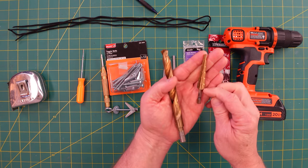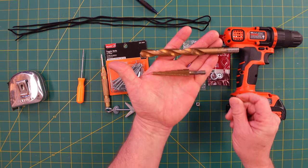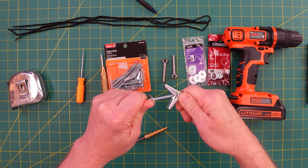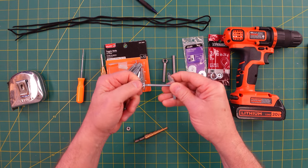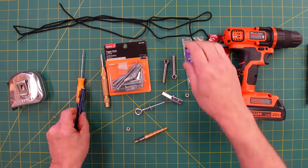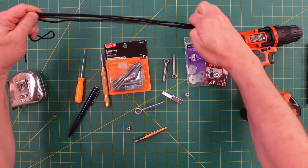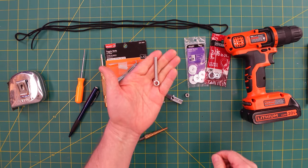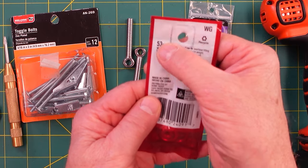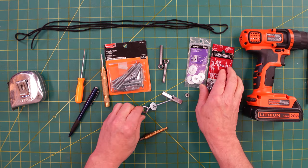You'll need either a step drill — this one goes to half an inch — or a half inch drill bit. Step drills are usually more expensive because of the difference in material used. I'm also using nylon lock nuts on the end, because sometimes when you're tightening up toggle bolts, the wings fall off into the wall and make your life miserable. I'm using 350 pound paracord; you could use 500 pound but I think that's overkill. These eye bolts are rated to 53 pounds each, so that's 106 pounds total — and the television only weighs around 100 pounds.